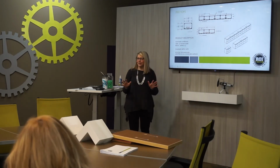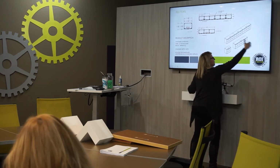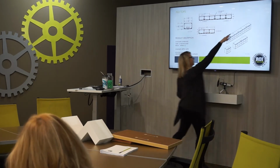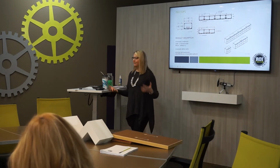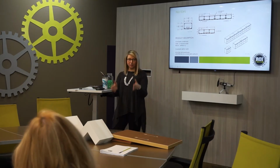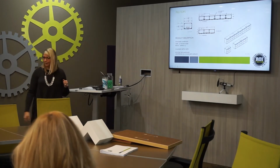So it's a little kooky, but it's one of those things we learned over the course of time when we're installing all these long file banks. You learn over the course of time that gradually the seams start shifting off of the files below. So then we started to realize, okay, when we do those situations, we really have to be cautious of that one in the center. But mostly all your credenzas and everything are always going to have some kind of overhang. So if you tell me you want a 72-inch wide credenza, I'm more than likely going to make it 72.5. So you're going to see the 2 cabinets below are going to be 36, and then I'm just going to make the top with an overhang. And your tops are going to have the same overhang as well.